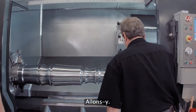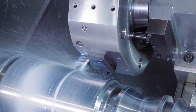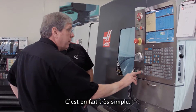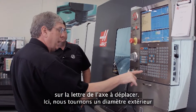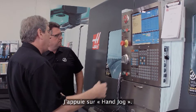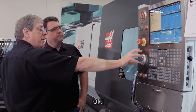We're at the point where we wanted to stop on this part. It's real simple — Feed Hold stops the motion of the machine. I press the letter of the axis I want to jog; in this case we're turning an OD so I'm going to press X, press Handle Jog, and now I'm in jog-away mode.